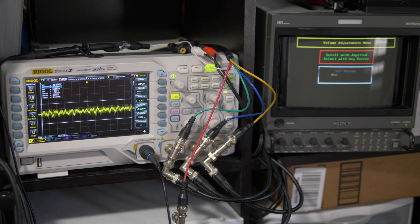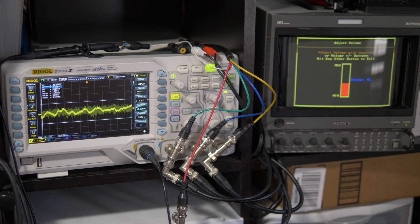You can do the same thing with games that have volume control in their service menu. Here's MK4, and we can see that setting it to around 30% is safest on this board. I strongly recommend making a note of the setting, either by marking the pots with a sharpie or by leaving a sticky note on the arcade board reminding you what the audio should be set to.